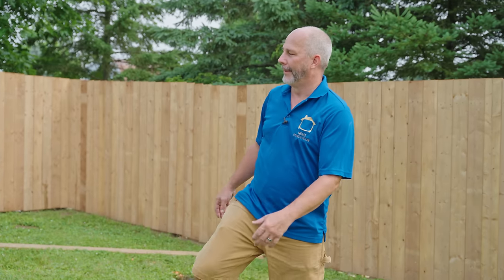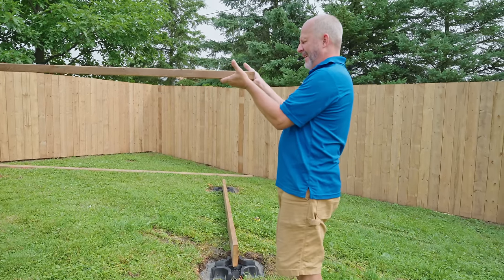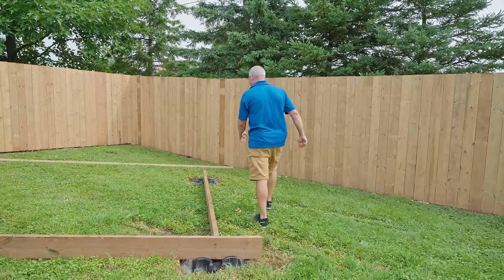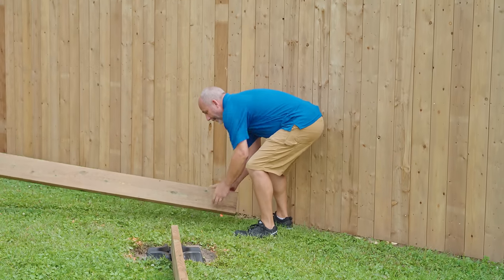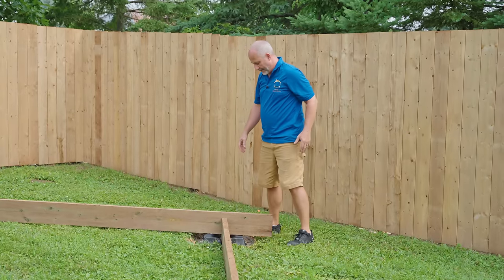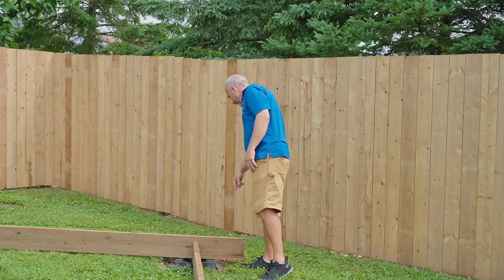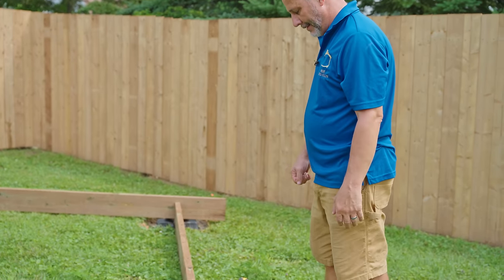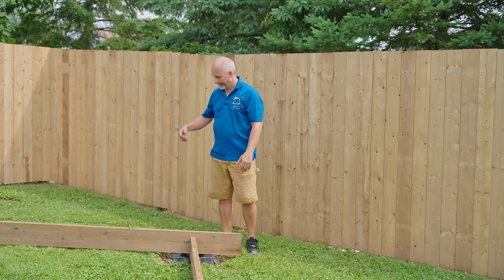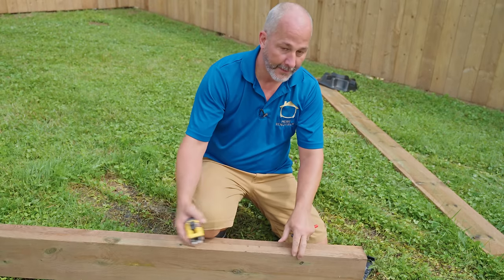Making the holes a little bit bigger would not have been a bad idea. Let's go across the front — where's our crown? Looks pretty damn straight. We've got to make the holes a bit bigger. I think what's probably best is to dig the back side of this hole out a couple more inches. While Matt's doing that, I'm going to bring this board up front and we're going to mark off for our floor joist package.